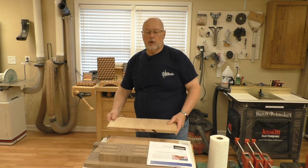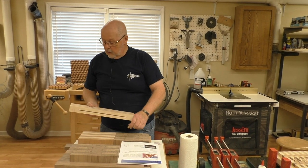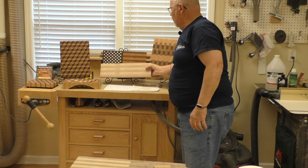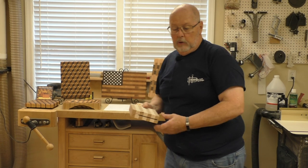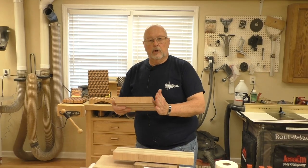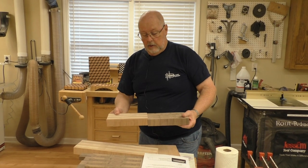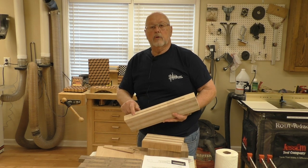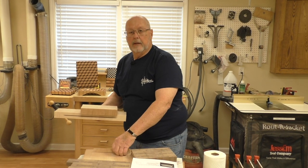They are edge glued together. Once all glued up into those 11 pieces, you go to the table saw and cut them into whatever thickness you want — typically I cut an inch and a half to finish close to that thickness. Once you've got your strips cut, glue up three pieces of cherry and three pieces of maple for the bottom part of the flag, and four pieces of cherry and three pieces of maple for the top section. Cut the top section to eight and a half inches. On the router table, I cut a groove on the lower part, upper part, and the edge where the stars go, so I can use splines to align them.